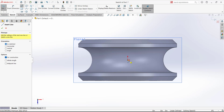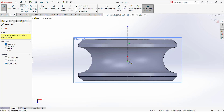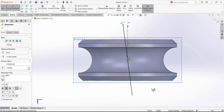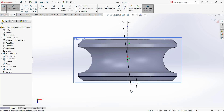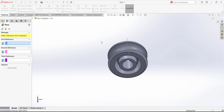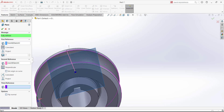Draw a vertical centerline, then use the Line command and select Midpoint Line so this will be the midpoint. Add an angular dimension between the reference line and this midpoint line — the angle is 7 degrees. Define the dimension between this edge and this point as 0.1. Hide this plane and add another plane by selecting this line, this point, and a second reference line, creating a plane perpendicular to this line and coincident with this point.